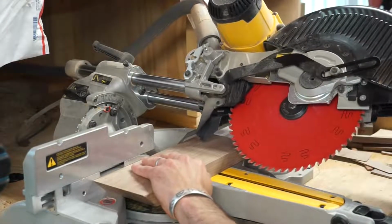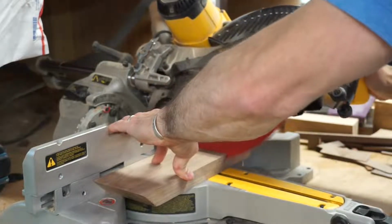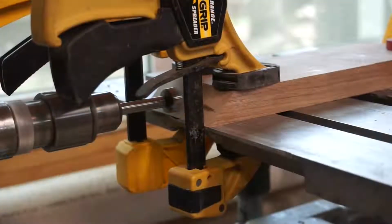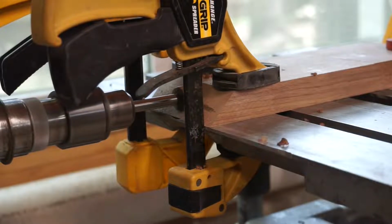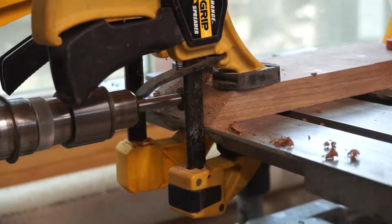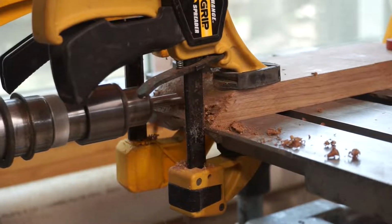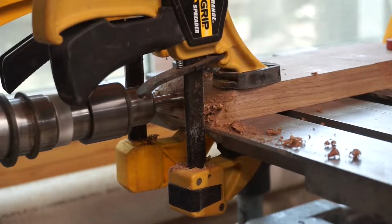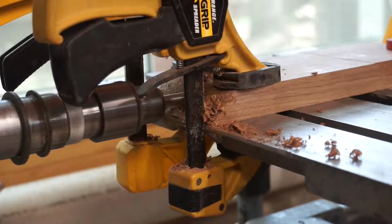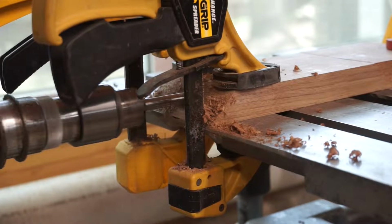With the remaining wood, I make another miter cut at 9 inches down, which will serve as the side of the holder here. I'm now going to make a pocket for the argon cylinder, and the way that I'm doing that is bracing the wood for my Shopsmith so that I can take a 7/8 inch drill bit and core a hole right through the center at 4.5 inches down. Now this is going to be difficult unless you have a drill that will allow you to drill sideways like this, and one that has a throw that's going to be a minimum of 4 inches.